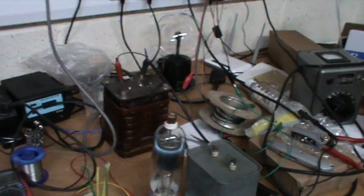Let's dim the light so we can see that a lot better. I think the camera should pick it up. Now if you actually had that in a transmitter or power supply, that would look quite nice. If you were running say SSB or AM, that vacuum tube would be flickering in time with the modulation, which would be quite nice. So if we had four of those tubes arranged in a bridge rectifier configuration in a nice big power supply, I think you'd agree it would look quite cool — slightly more interesting than the bog standard silicon diode. But it does come at a cost — you've got to sort out a filament transformer and the space and other inconveniences. But at the end of the day, it does look quite cool and that's what it's all about.